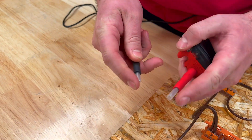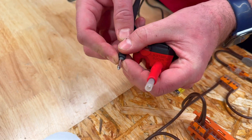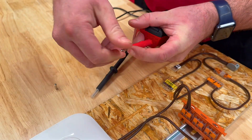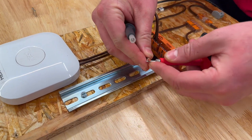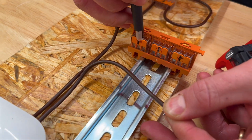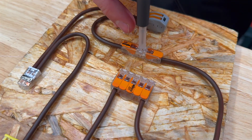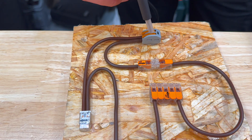So here we have it. If I just pop these back and check, make sure we're getting continuity between these — you can see there we have it. But if we just take off this tip on the end, which isn't stated in the manual, we just remove them by unscrewing them. And if I probe onto the 221 in there, we get the continuity sound on that one. And if we just move across to the 221 inline here, we can probe on the top there and again we get continuity, moving across onto the 222 connector.